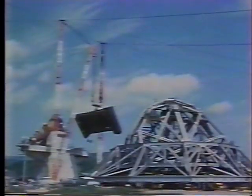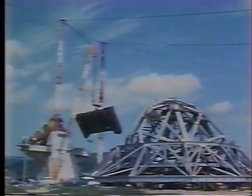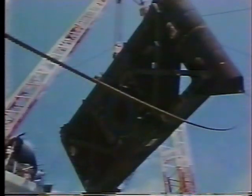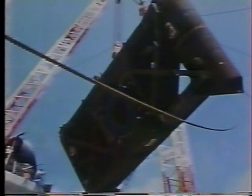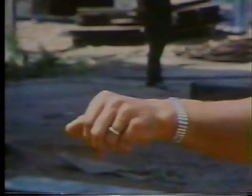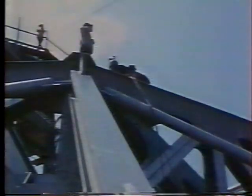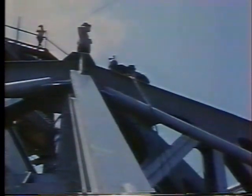Thus, neither hoist was overloaded, but position control could be only by tag lines. Again, the piece will not pass between the derrick booms and must be angled through. Now on the north-south center line, the hub must be drifted south and lowered at the same time. Coordination of the separate derricks to do this is essential.